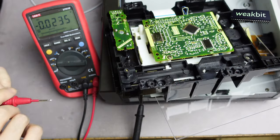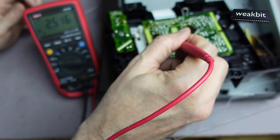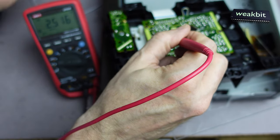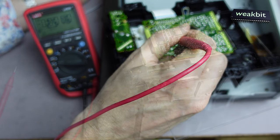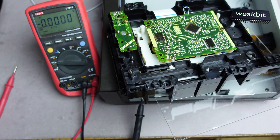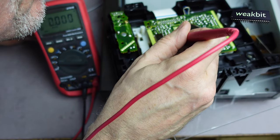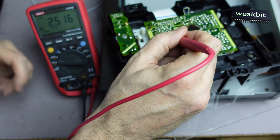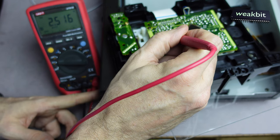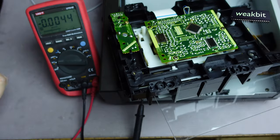Here also five volts. On pin number 11 — on this side, R7 — we should measure two and a half volts. It doesn't spin up. No voltage, it's off. Now it should spin up. Looking at the plan, the V-reference for the four operational amplifiers inside is on pin number 2 — so we measure pin 2. Two and a half volts — correct. But with 2.5V reference there's no control information for the spin start.